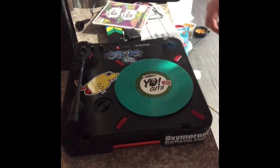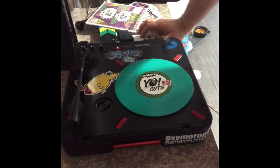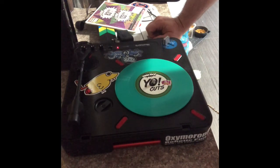Hey everybody, sorry I had to do some repairs. Those last couple clips were about the capacitor that you have to remove. Long story short, be sure to watch the install videos. I didn't do that, and I actually paid in the long run. But my problem was a little bit more weird. When I would move the fader back and forth, it wasn't doing anything, and it's because underneath the capacitor there's a little strip, a connector, that runs underneath there, and I actually trimmed it with my wire cutters in my haste. So I had to put in a jumper, and that fixed it.